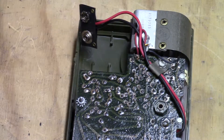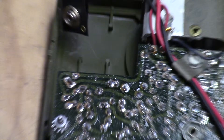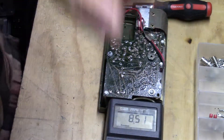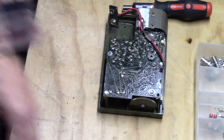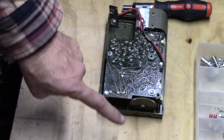Since I don't have a GE snap radio battery that will fit, I'm going to use a power supply. Let me check it again here - make sure it's really nine volts. We don't need any accidents; this is probably full of germanium transistors. It's 8.5 volts. This is really annoying - my bench is already crowded enough without a camera on it, so you're kind of looking at this at a 90-degree angle. The radio actually runs longways this way, and this is the front of my bench.